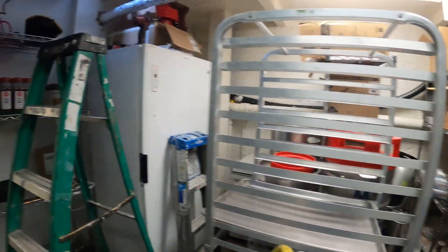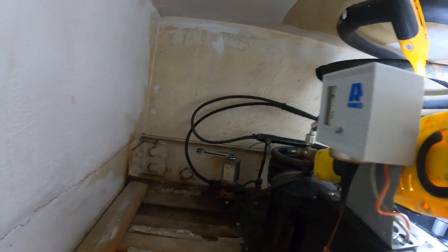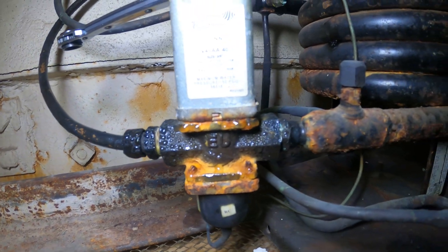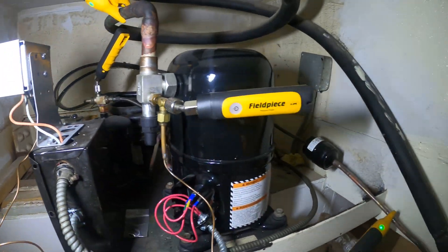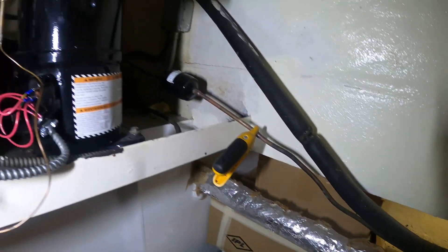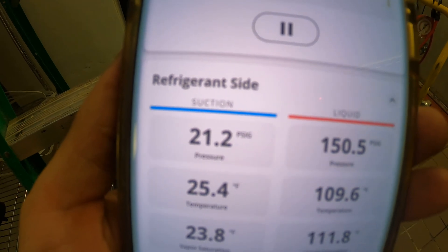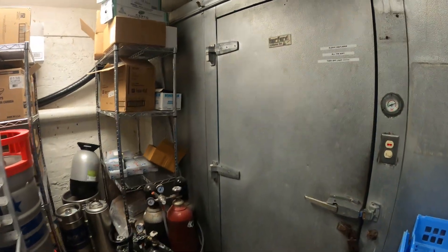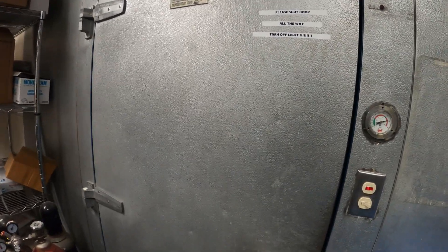This was a great job. Honestly, this unit is in really poor shape. As far as that coil, it really is rotting away — this looks like a leak waiting to happen. We've had quite a few service calls on this unit in the past year, and it might be time for an update. I adjusted the water regulating valve. Now the head pressure's down to 150, back pressure's at 21.2. Our suction line is pretty cold — it's going to do the job. It's just a matter of time before the temperatures come down, and everybody's going to have cold beer.